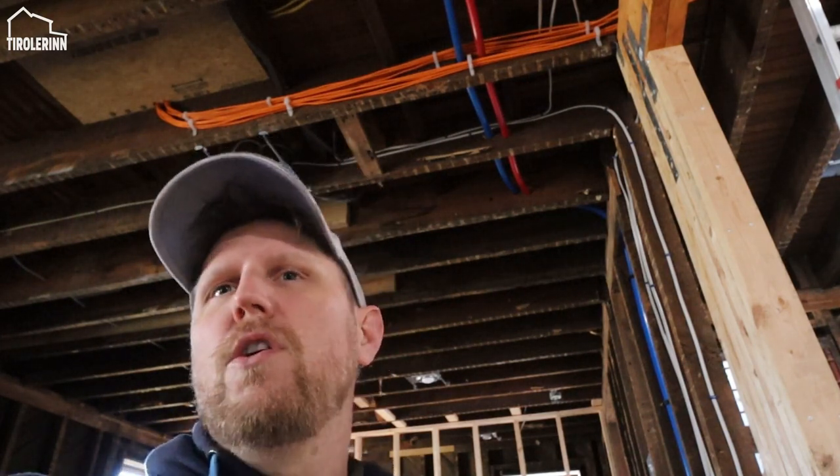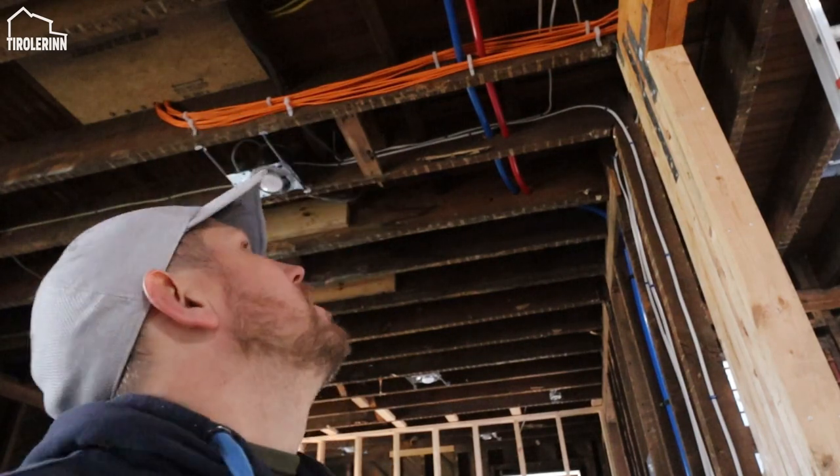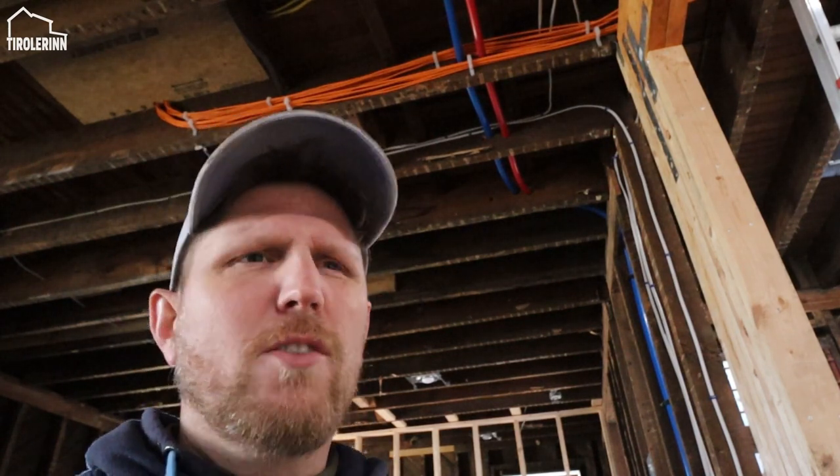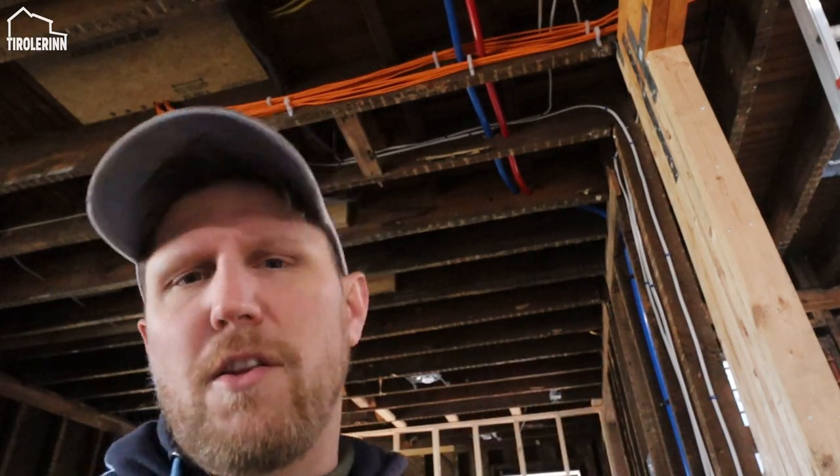There will be at least one circuit that I'm running to, because it allows us to maybe attach at one point a TV that runs the news or a calendar or the cameras for the security cameras on the outside. So I still have to run that, but everything else is done. I ran already 16 different cables all over the place. So I think at the end, I'll be around 30 to 34 different cables of CAT6 that I need to run.